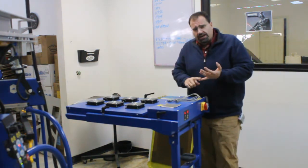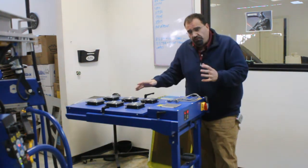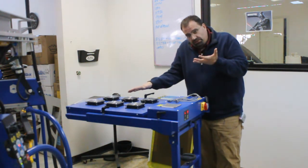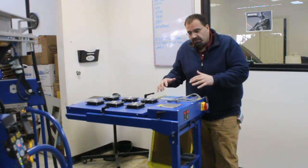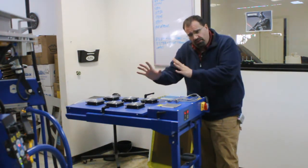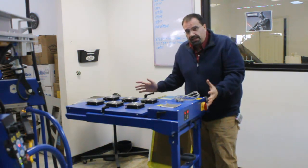So it's time, intensity of the bulbs, height, angle. If you're printing a hoodie, as an example, you may want to raise the flash and tilt it forward so you don't scorch. So make sure you're looking at the mechanics of the flash and how it interfaces with the machine electronically and mechanically in your workspace.